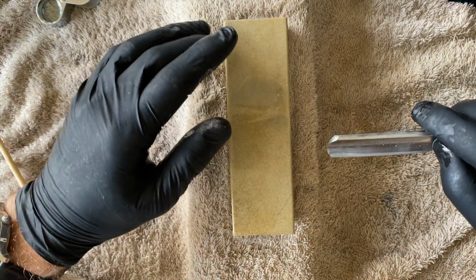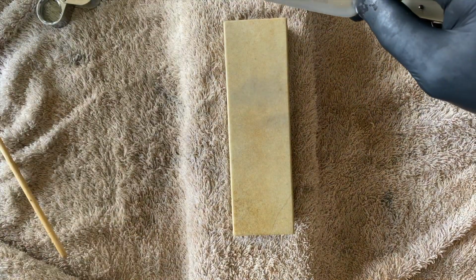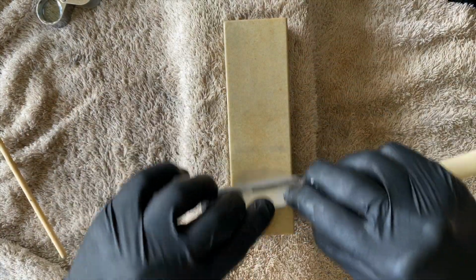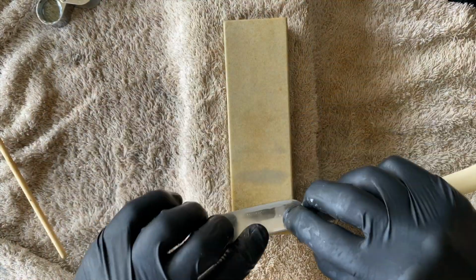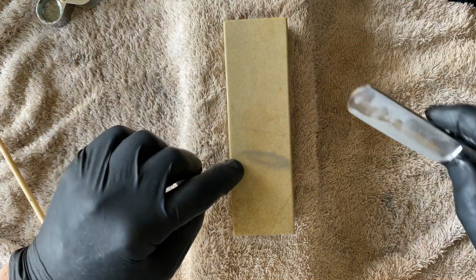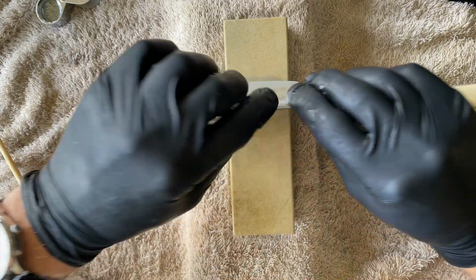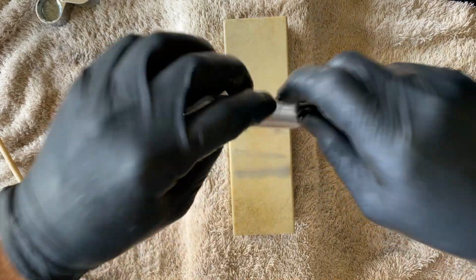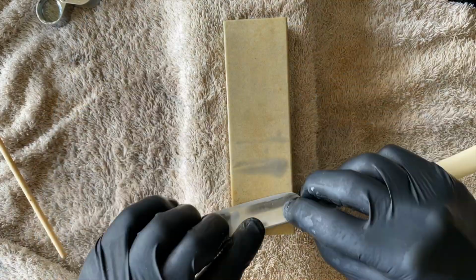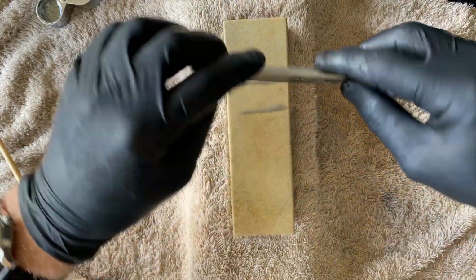If you're going to dress it, let's say with a coarse diamond plate of 140, you're not necessarily going to need to use a little plate like this to create a slurry. If it's that coarse, the dressing, then those bits will come loose by itself, and so you just keep working the stone. So if you've got really heavy lifting, finish the stone quite coarse. I finished this one at least 400, just for the purposes of this. I've never really done any stones in any shape or form coarser than that. And yeah guys, I think we have got a bevel set here.